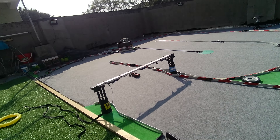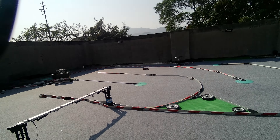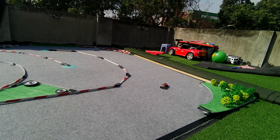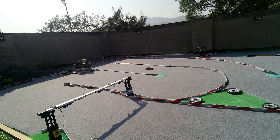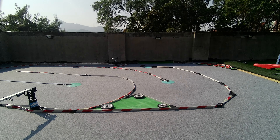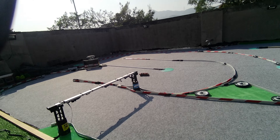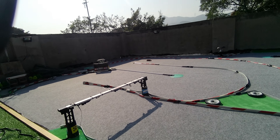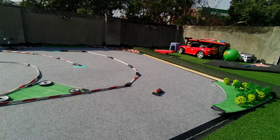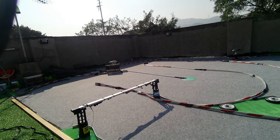I actually think this is a better steering geometry. The problem with the central axle I had before, linking the left and right uprights, was that one of the screws was higher on one side than the other for the steering link, and that was reducing the travel of the suspension on one of the two sides. This way I have the exact same suspension travel in the front on both the left and the right.